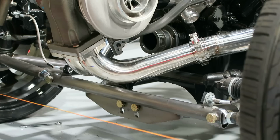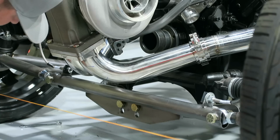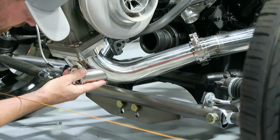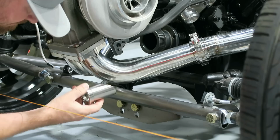And what I like to do in circumstances like this is I'll just drill a little hole about where this thing's going to go. I'm not going to worry about trimming this hole perfectly right now. A good bit of overhang flange will actually help dissipate heat once I go to weld this thing. It'll be easier to do and keep it from burning through. I just need a big enough hole to allow gas coverage to get on the inside of this thing. And what I'll do is I'll tack this one on.